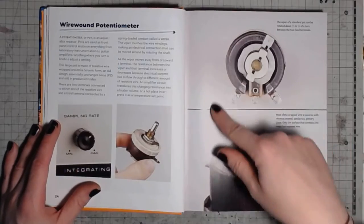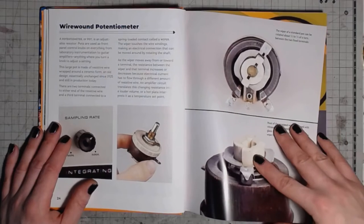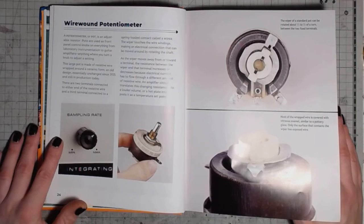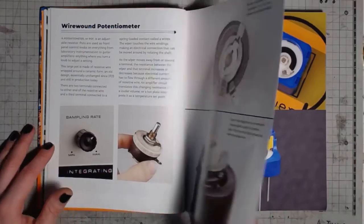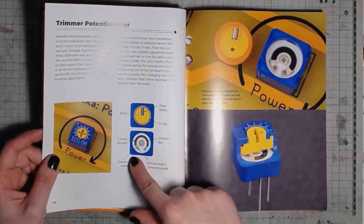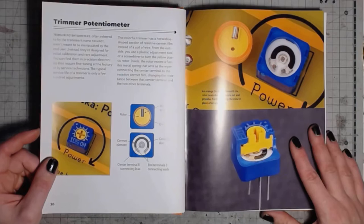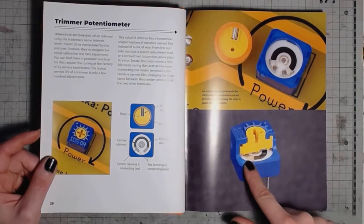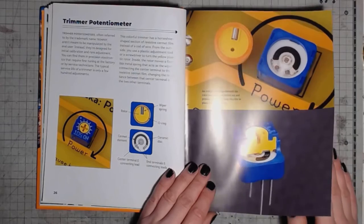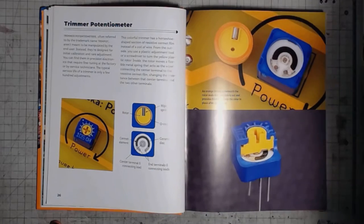The rheostat, wire wound potentiometer, or variable resistor if it has two terminals. Pretty common in antique electronic devices. Big, heavy, but magnificent. Trimmer pot is made with cermet element with ceramic disc. Good quality part. Those trim pots don't use the phenolic or plastic base that you would often find in some lower end trim pots.